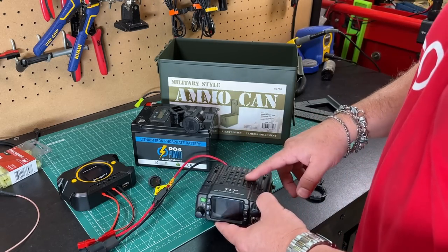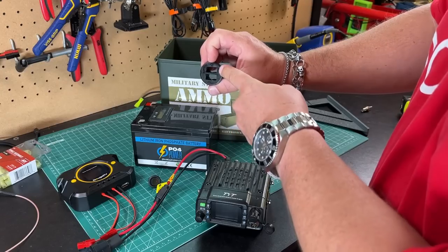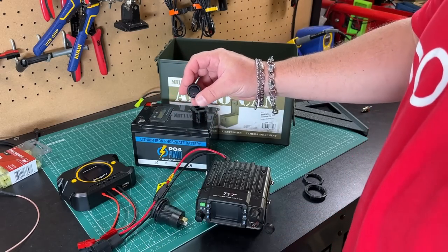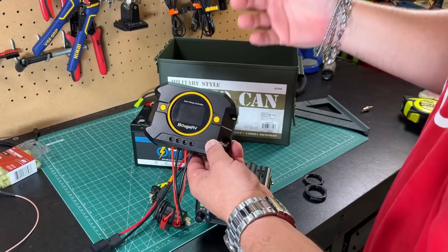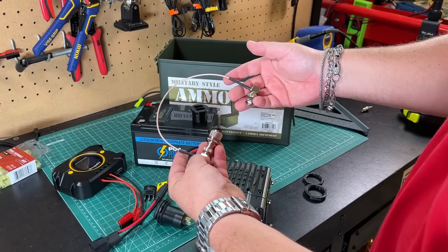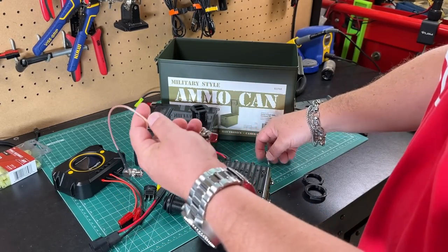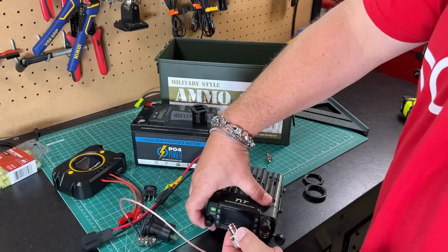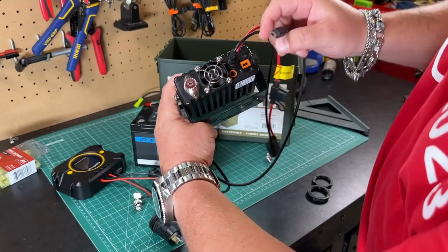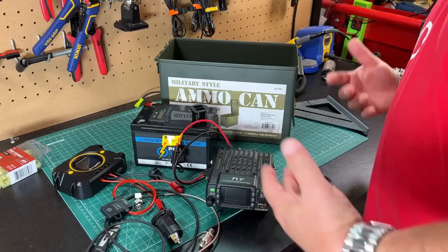I'll have them in my Amazon store with a link below — just look for the ammo can category or something like that. So we've got this TYT8600, a cool 25-watt radio. I've got a USB and voltmeter. I'm going to throw a power pole on here, so I'll have a solar input and a way to charge it or take power out — an input and output. I'm just going to use one switch to power everything, and then I've got this solar charge controller. This is like a 10-amp charge controller. We're going to use some RG316 — I'm going to cut this and put a different connector on it, drill it into the box, and use that for an antenna connector. I'm going to use an adapter for the back of the radio's SO239, and I'm also going to plug in the programming cable to the back of the radio before I mount it so we can program it out in the field. We'll just have a fuse in line for everything. So that's the plan.